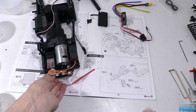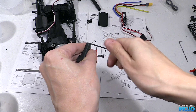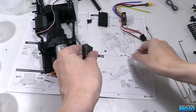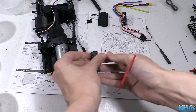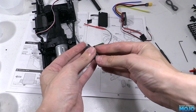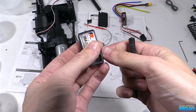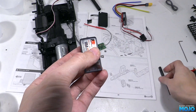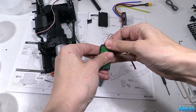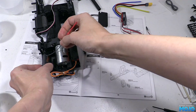The problem is where the antenna comes out of the end — it makes it just a millimeter or so too long. To make it fit we need to open the case up. It's held together with just four very small screws, so they need to come out. We remove the board and put it somewhere safe. All we need to do is trim that little nub off the end and make a slot so we can run the antenna out of the top rather than the end. The plastic's so thin it only takes a couple of touches with a Dremel. When we put it back together with the antenna coming out of the top we've got a radio that's a perfect fit in the box — almost designed for it.